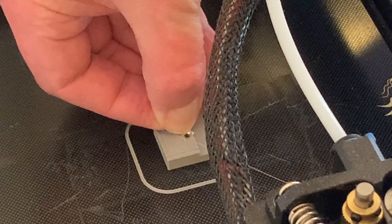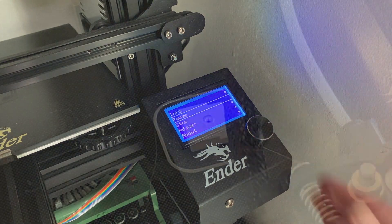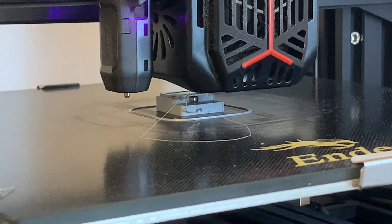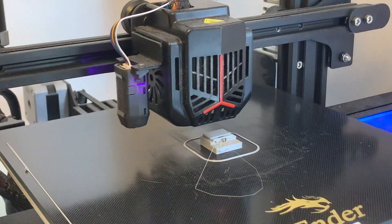But when we finally got it pressed in and the top of the nut is below the edge, we're safe to resume the print, which will start building the layers above the nut trapping it in place. In my prototype I've left the overprinting to a minimum so I can see what's going on, but even though there's not much over the nut there's enough to hold it down.